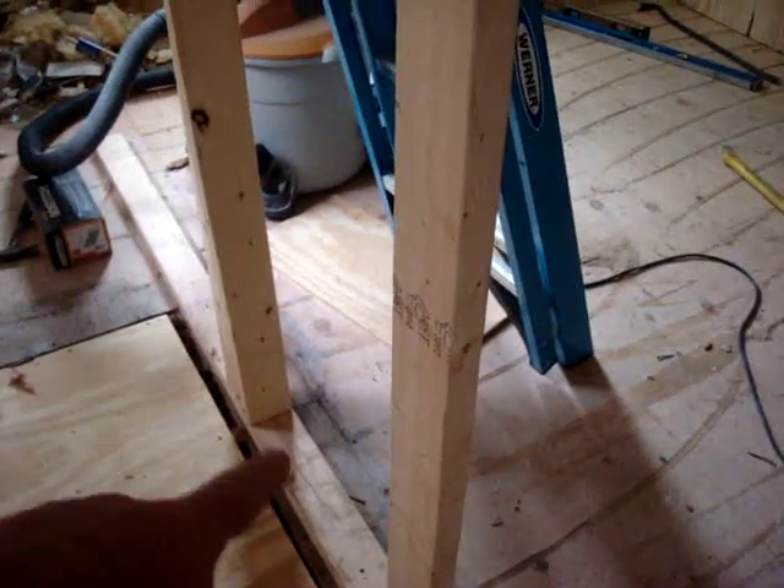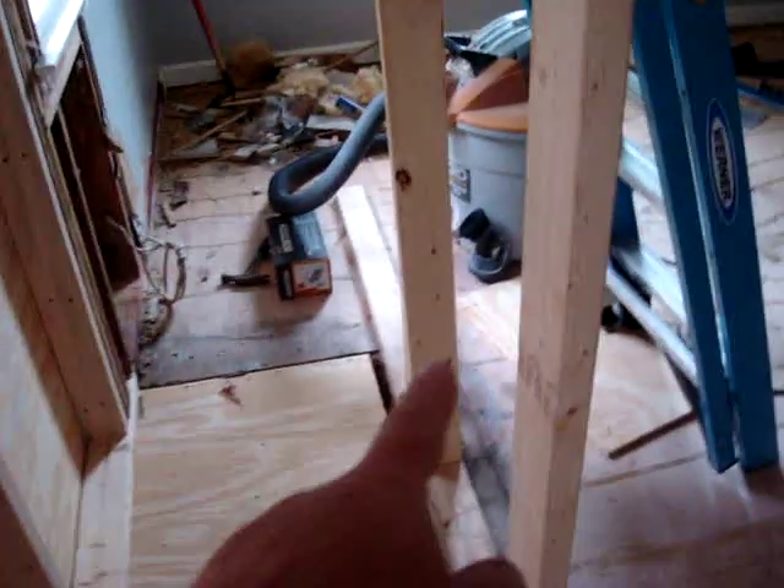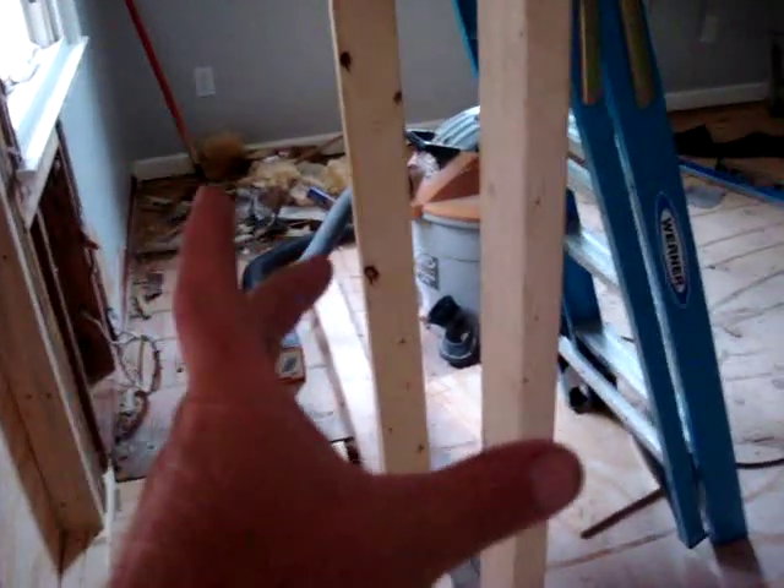To do that, Josh built this temporary wall — there's a temporary sole plate down at the bottom and these two-by-fours go up to the trusses. It's about 18 inches from the wall, which is perfectly acceptable. This one is bearing the load of that truss all the way down while we took the real wall out. This one is just tacked on at the side in a little L-shape for extra reinforcement — probably unnecessary, but we did it anyway. The load is carried down to the floor.